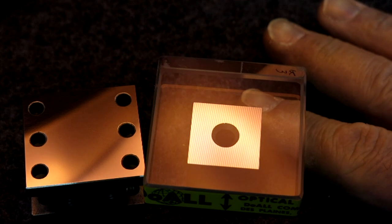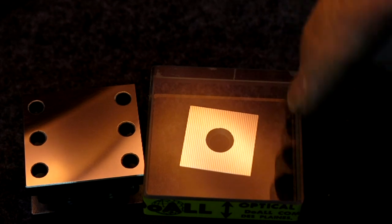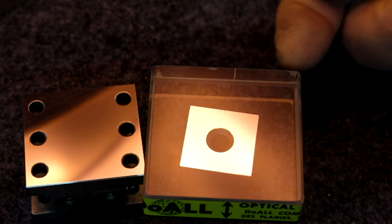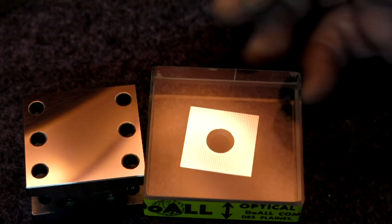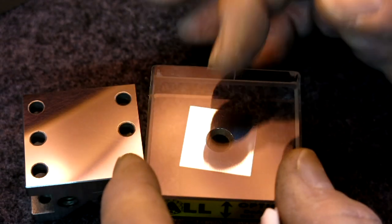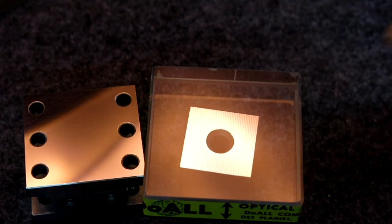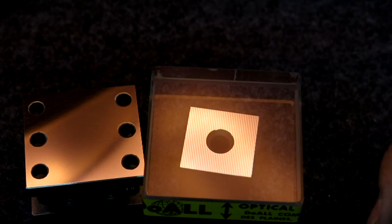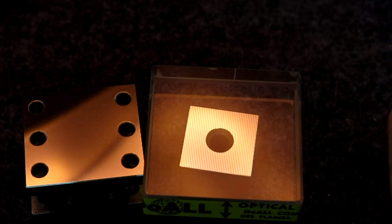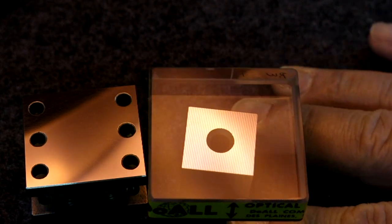Oh yeah, you can see them — see how those are really straight? The spacing doesn't matter in this case, that just means the wedge of air is thicker; if I push down on these they'll spread out a little bit. But what we're looking at is how straight those are, and those are really straight. That is flatter than 11 millionths of an inch — I think gauge blocks are flat to less than five millionths. That's kind of cool.